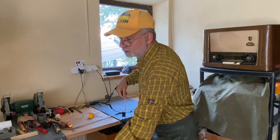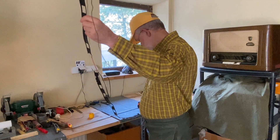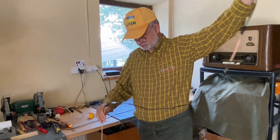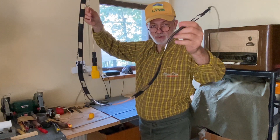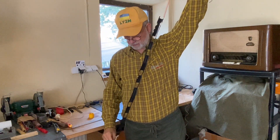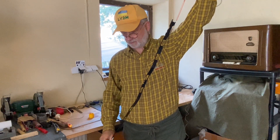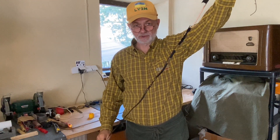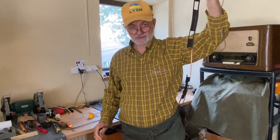Here's the pipe, and here's the antenna. Basically you can use this ribbon antenna as a roll-up antenna. The only issue is that as long as you put it into the plastic pipe, the tube has its own velocity factor, which means you need to shorten the antenna.